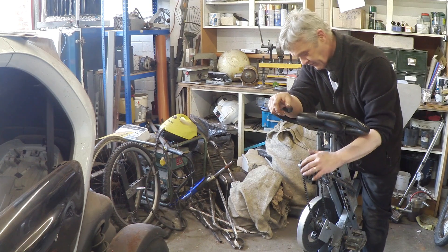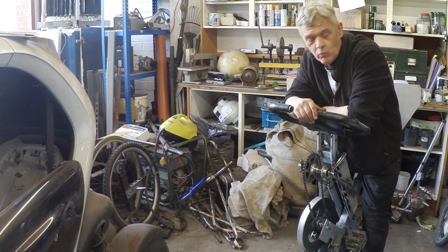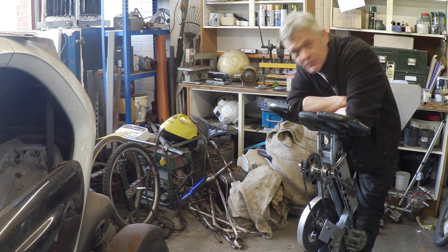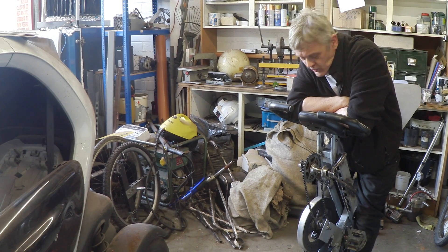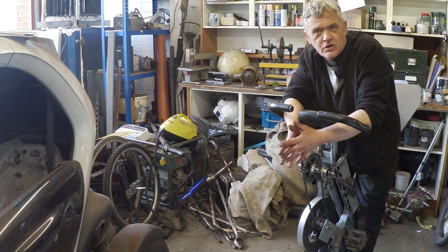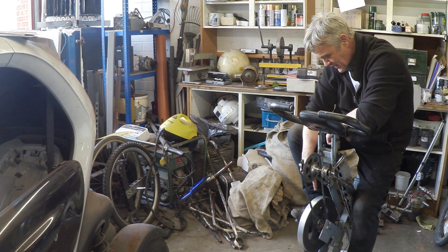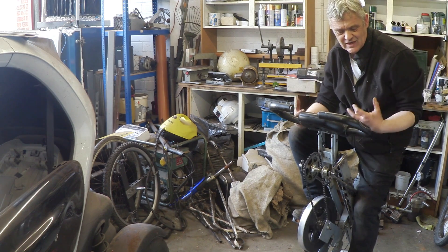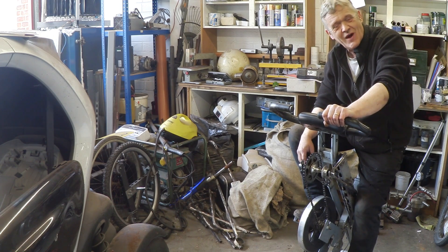There it is finished. This is the actual takeoff here, connected to one of the gears in the cluster, and the other gears - of which there are five - are takeoff points depending on the gear ratio we want. You can actually change the gears in it, which is great because sometimes you need high torque, sometimes high speed. We started this series in videos 1097 and 1099 for Mark 1, 1106 was Mark 2, and this is Mark 3 - basically all chains and teeth. This is a much more robust version - the flywheel works beautifully, spinning nice and free. Anyway, I hope you enjoyed the Dynapod - it will take all the adaptations from the other Dynapod series on the Pedal Power playlist. If you did enjoy it, don't forget to subscribe, and thank you very much for watching.